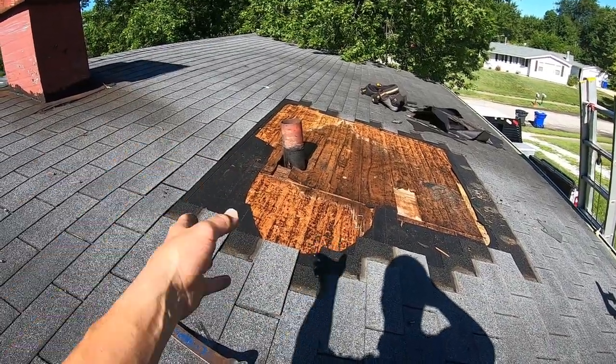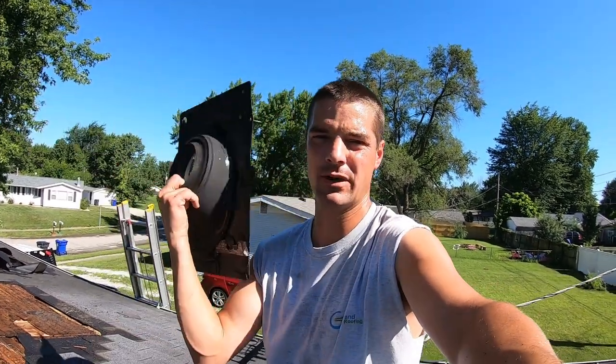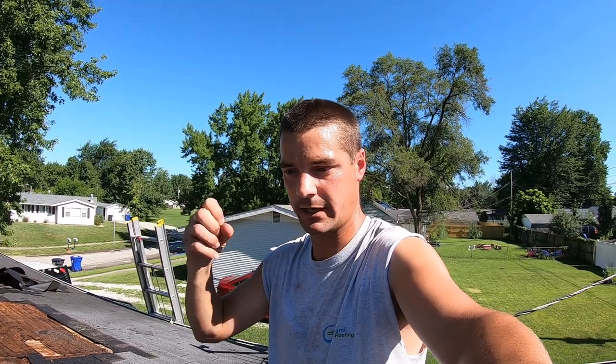There's ceiling damage, insulation is all wet and nasty — it's just as shitty. I hope this video helps. I planned on doing a video with one of these in my freezer for a few days to simulate a cold weather application — whether it's springtime, fall, or winter — and a coil nail blowing through it. The tip of the day: if you're going to use the economy version, use a hand nail and a hammer. It's going to gently go through it a lot better — a coil nail spider-web cracks through it. You don't want that in something that's diverting water.